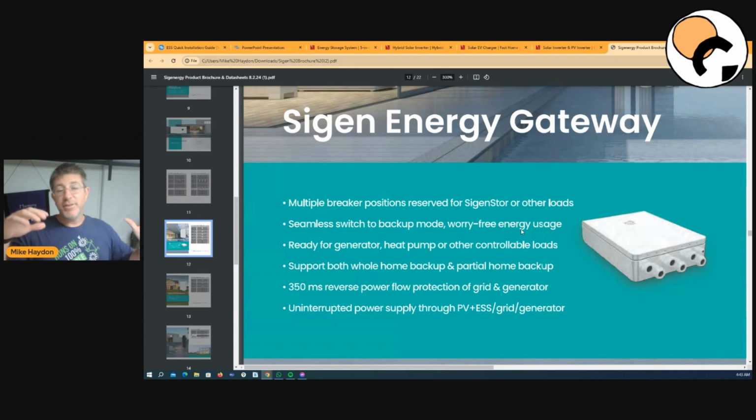And so if you've only got a 5 kVA Victron and you've got the electric oven, the kettle, the toaster, all that stuff turned on, and you don't have enough power, it'll grab it from the grid and it'll all go through the Victron. In a blackout situation, you can choose what to use. So you can say, okay, well, I'm going to use the kettle now. I'm going to use the toaster. I'm going to turn the aircon on. Everything in your house is running through it.